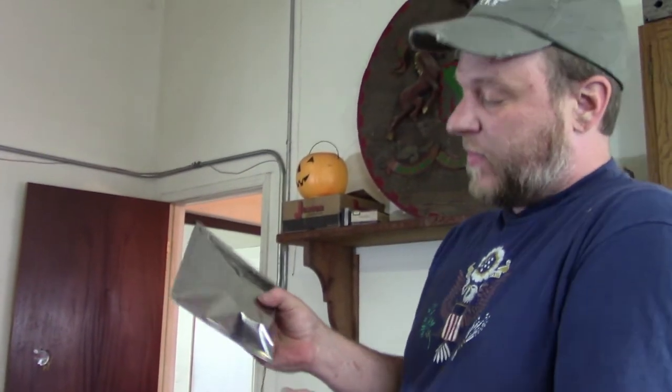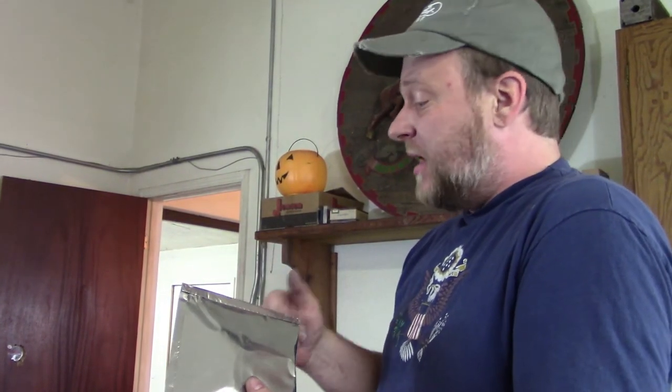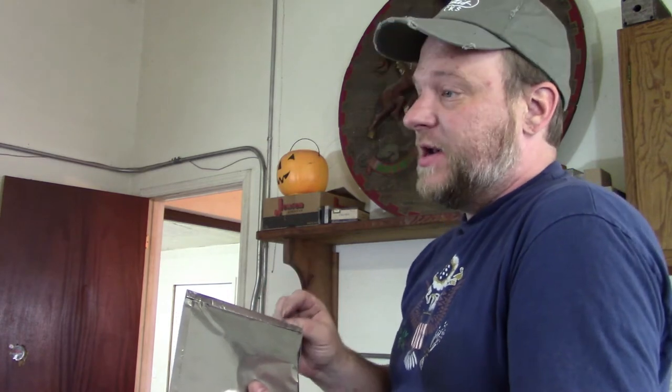And there you go — nice and clean. Now you can actually buy stainless steel bags that are preformed and open-ended. Honestly the stainless steel is not cheap, but if you're only doing one or two and you've got it built into your margins, I would suggest buying the stainless steel bags, because there's obviously going to be less possibility of oxygen getting into your bag. Considering the amount of steel we harden and temper here, the bags are not economical for us, so we buy it in stainless steel sheet rolls.